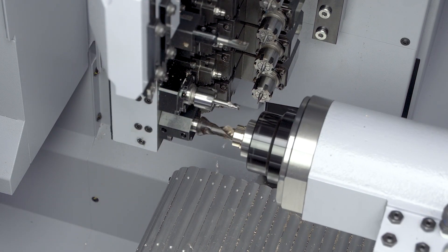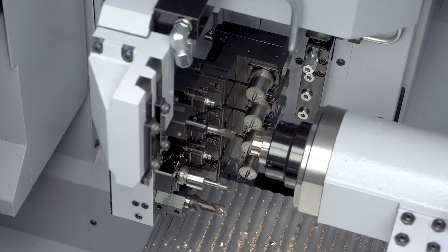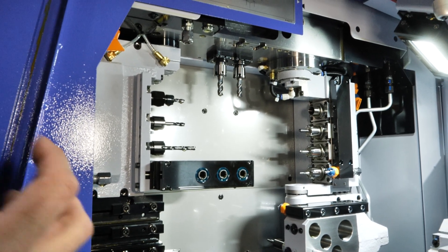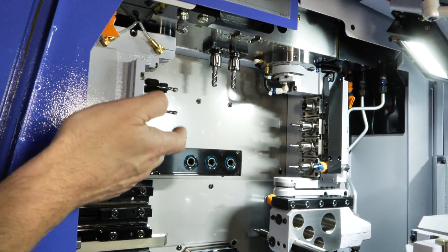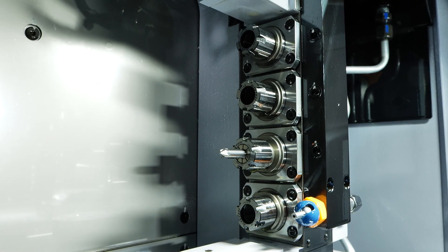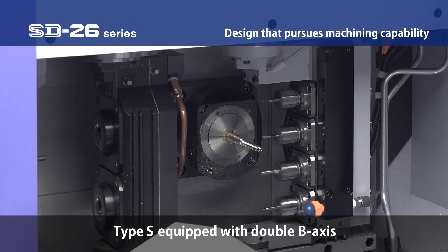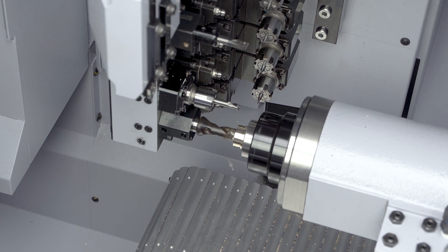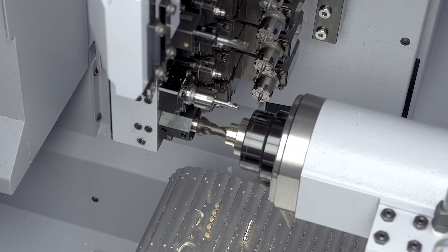In addition to the increased overlapping capability, we have a lot more driven tooling on the front end. For a platen-type machine, as you can see, there's four driven tools where you can put cartridges — so we've put a triple front base in. There are two stations at the top where you can fit a gear hobbing unit. Then you've got a four-tool fully programmable B-axis which is counter-face, so it can do angular work on the backside, plus turning tools on both sides, static drilling, and an additional deep drilling station at the side of the sub-spindle.